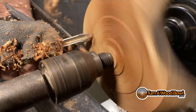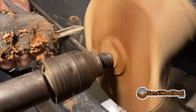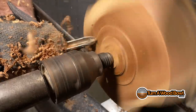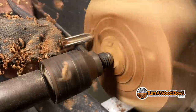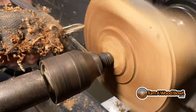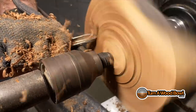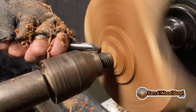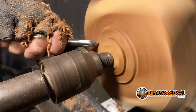A small bowl like this is a great example — it would be difficult, although not impossible, to create a nice foot and have this held on the lathe with a recessed connection. So what I'm doing is rough-shaping the tenon and shoulder, which will become the foot eventually. Now I'm switching to my 3/8-inch spindle detail gouge. This is going to allow me to put a really nice, crisp dovetail angle on the inside of that tenon, which will match the angle of my four-jaw chuck.